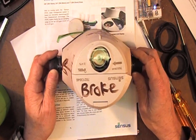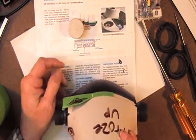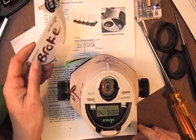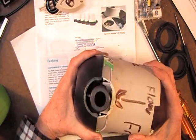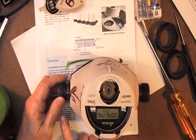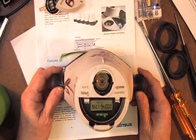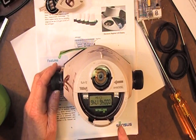The water moving through here is nominally a conductor — most drinking water is a conductor. Using the battery they've wrapped a coil of wire around this throat or narrowed-down section, established a magnetic field, and put some stainless steel, tantalum, or some exotic metal contacts touching the water flow. Water flows, the magnetic field generates a voltage — that's basic generator theory. Measure the voltage and you can measure the velocity; the velocity and the voltage are directly related.